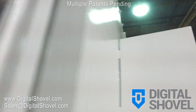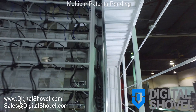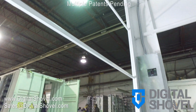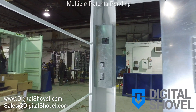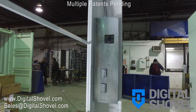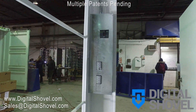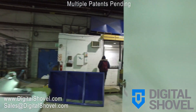One other thing you'll notice is we have our main connection for the container itself coming out of the top of the splitters. But over here, we have our auxiliary panels. Our auxiliary panel feeds our lights as well as our fans. It's set up like that so that you can run a separate service if you want to without having to run it off your main. And if you lost your main feed for some reason, you can be running a backup generator on the rest of your supply setup.